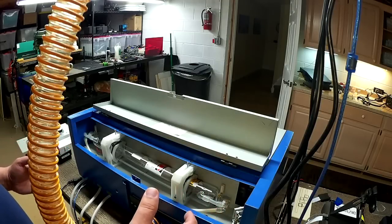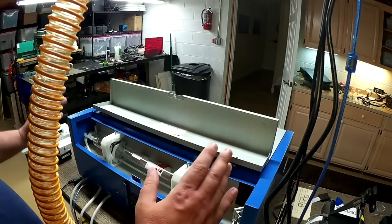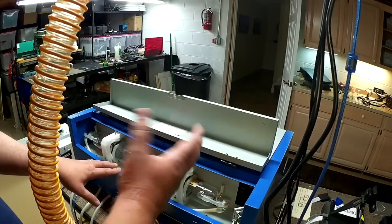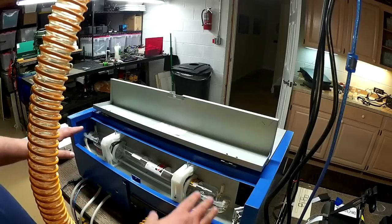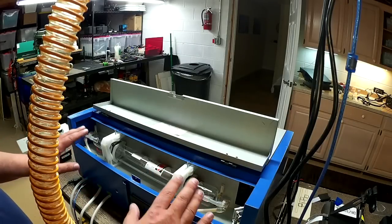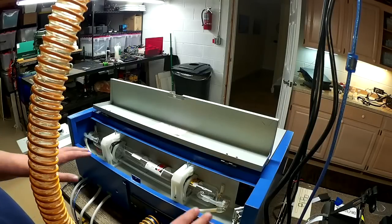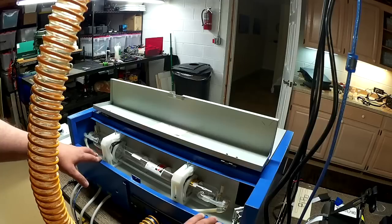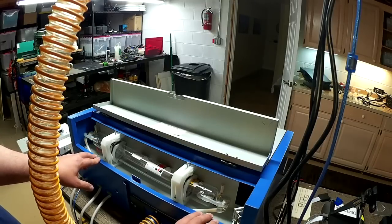If you are going to deal with high voltage — and again, I'm only documenting this, this is not educational or a suggestion — work with your right hand, because it is furthest from your heart. It stops you from creating the circuit through there. Also, always when I work with electronics, even low voltage, I don't take a chance. I always wear rubber sole shoes, and many times I have rubber mats in my work area to separate me from ground, because the biggest thing you do not want to do in a high voltage situation is get between ground and a high voltage source, because that will pass through you.